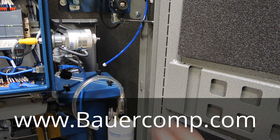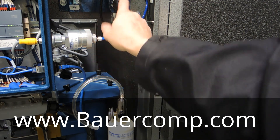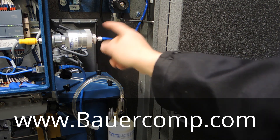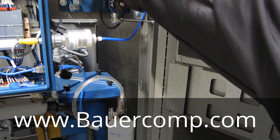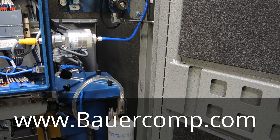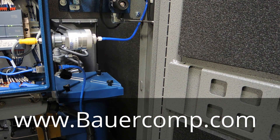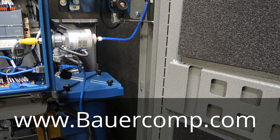One thing I forgot to mention: make sure to reconnect your sampling tube after calibration. This is the maintenance valve — make sure it's always left open. Make sure the tube is reconnected, then go ahead and start the compressor. Your regulator will pop up and if it needs any fine-tune adjustment you can do that right there. Before putting the system back into service after calibration, take off your test regulator and reconnect the tube from the low pressure system so you'll be sampling the air you're compressing.